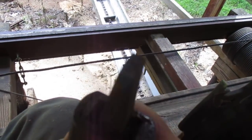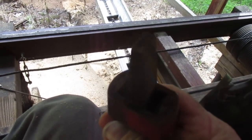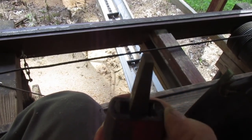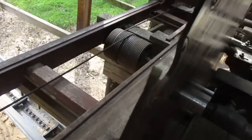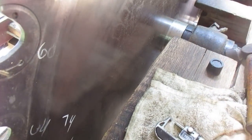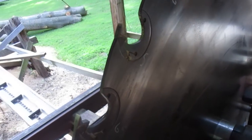I'll show you me doing that with the swedging tool. Here's my swedging tool — I've got the red side, which is the curved side, I marked that. Hit that first, and you don't have to hammer the heck out of it. This is the flat side, this is the curved side, and what it'll do — if you guys have never done it — it'll make this wider. I'm measuring all of them with my little handy dandy micrometer. I've got a crayon to kind of keep track of where each tooth is.